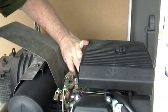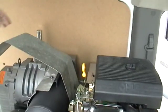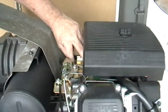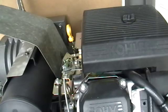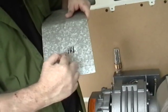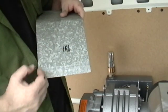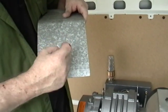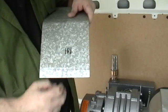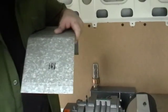So what we were interested in is double checking our horsepower load under operating conditions. So when we cranked up the machine and put it at 12 inches of mercury, it was at that mark. So let's just go over what these marks are. Now, that's idle, that's full throttle. So now, if you took that distance between these two marks and broke them up in 10 parts, halfway would be 50%. So we know that this was idle. That's 12 inches of mercury, the first one. That's not quite halfway. It's about 40%. It's rough. It just gives you an idea.